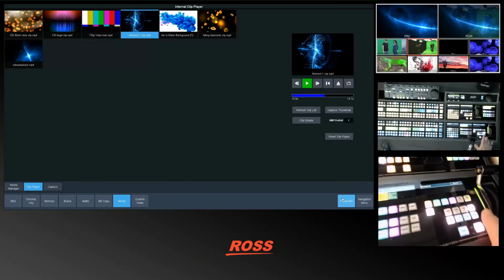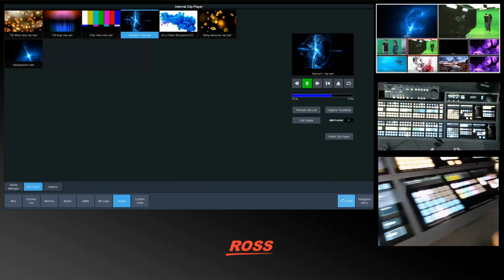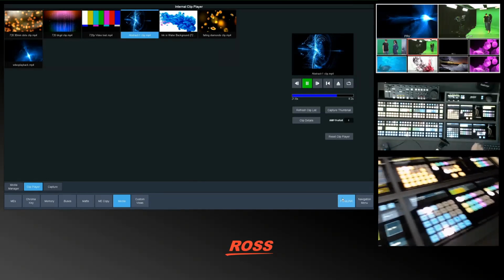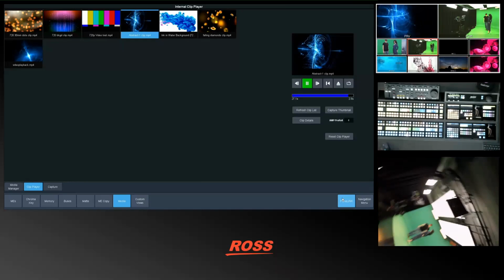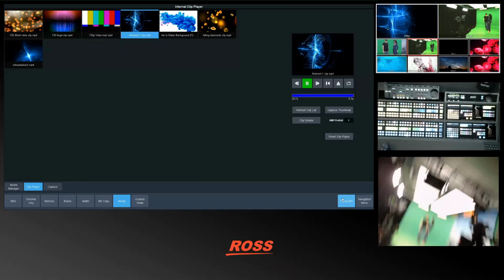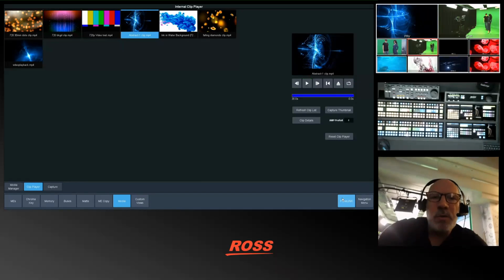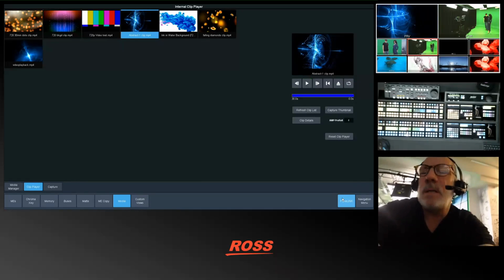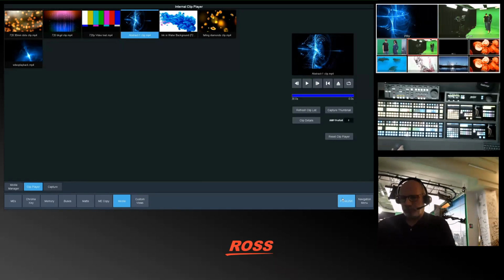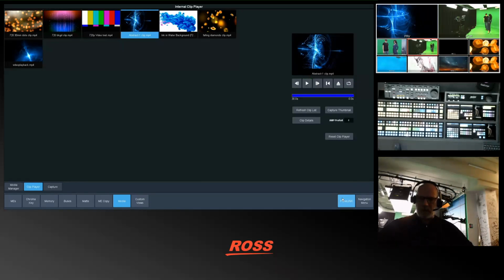And you can define the pre-roll on that, so you avoid any still frames or whatever. And that little functionality, by the way, also applies to anything you have connected. If you have a server connected, we talk AMP with standard protocol, it will also control any of that sort of stuff. So you can bring in external servers and control all those. It's another great little feature that's often overlooked, but it really helps your production, rather than the director having to shout VT, VT, and all that sort of stuff.